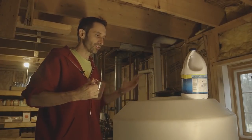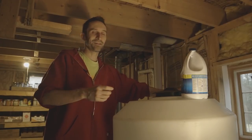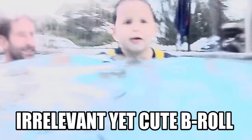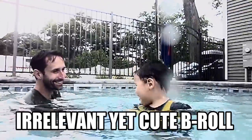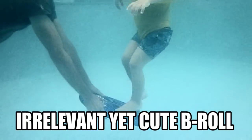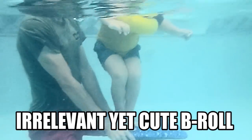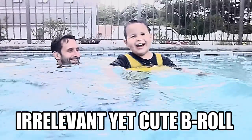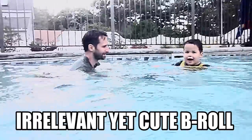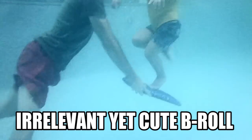Now I'm going to finish filling this thing up — that'll agitate it and swirl it all around. The water coming out is going to smell like a pool, like a public pool. So I'm not going to be using this water for drinking or cooking for a little bit because it'll have that really strong chlorine smell. I've planned to run a load of laundry and do some showering with this water first. Then I'll know I have a clean tank and can fill it up with water that doesn't have a bleach smell.